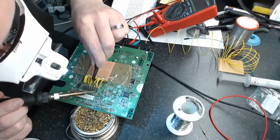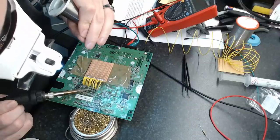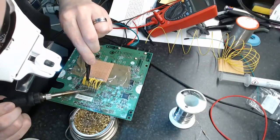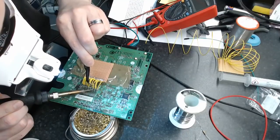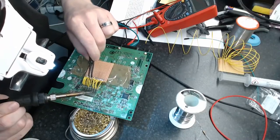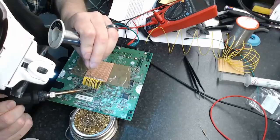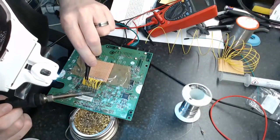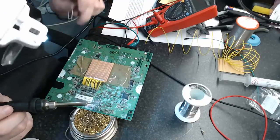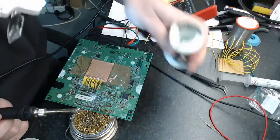But again, it's just due to the fine pitch connector and all this that we've got going on. And also the fact that I'm having trouble locating the connector, because what I would also tend to have done would be to just bypass this step entirely and just make a little breakout PCB. So just a simple PCB, there'd be no components on it, just the connector and a bunch of pads. We'd break out the 50 holes on there. And then I could just lay it out on the bench with discrete components, work out what I needed to work out, then we'd be all set. But due to the fact I can't really just grab that connector readily, we're going down this avenue. That's actually going pretty much okay right now.